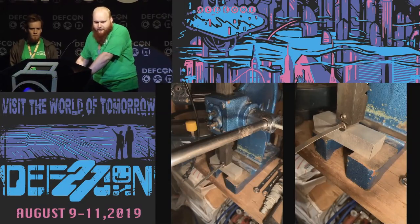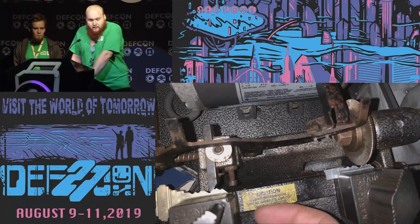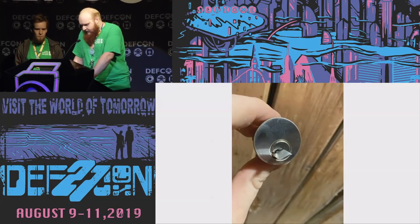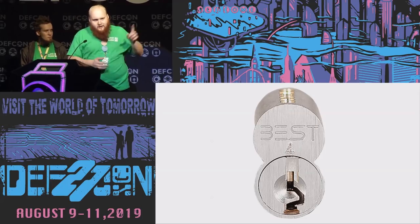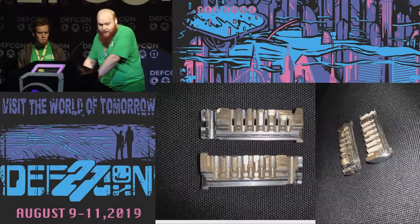So we do that, put a flat piece of metal in between them, press down hard, and now we have a blank. We can put it on the profile cutter, copy the bitting, and we have a duplicated key pressed out of the lock that it's supposed to open. And of course it works. For really paracentric keyways like this, really nasty keyways, this is a heck of a lot easier than milling. So it's a good tool to have in your toolbox.